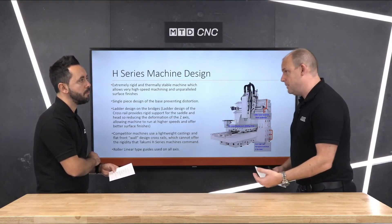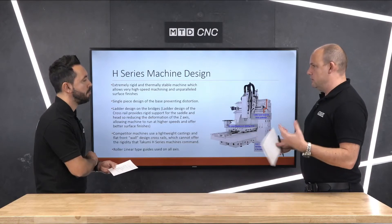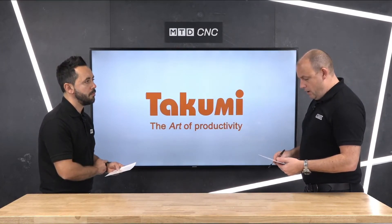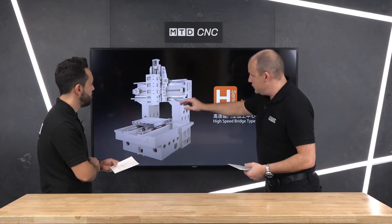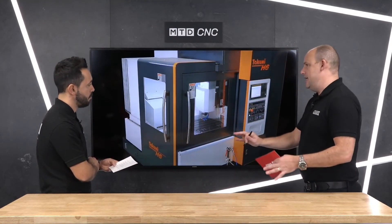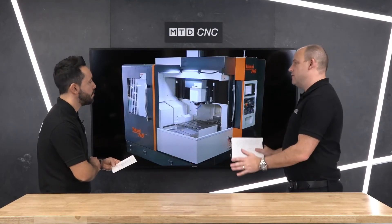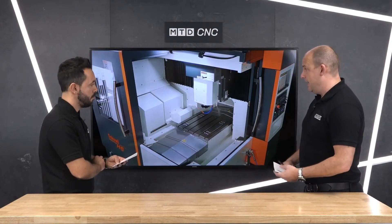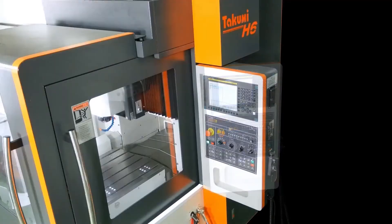Another interesting point — if we move on to the next video you'll start to see the machine in a three-dimensional format. One of the other areas I wanted to pick out is the spindle. On this particular machine they focus very heavily on keeping the spindle area separate from the rest of the casting. The reason they do that is because when you're machining you generate heat, and heat in any machining operation is the absolute enemy. You want to keep it as separate from the rest of the machine mechanics and casting as possible, because heat causes growth and any growth will affect precision. What they do is put a heat jacket around the spindle, keeping all that heat away from the casting to keep every area very cool.